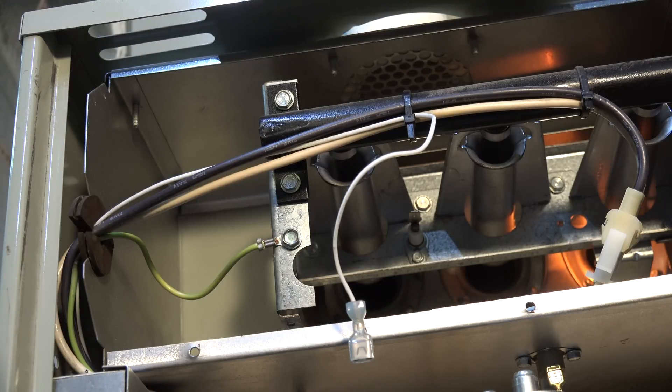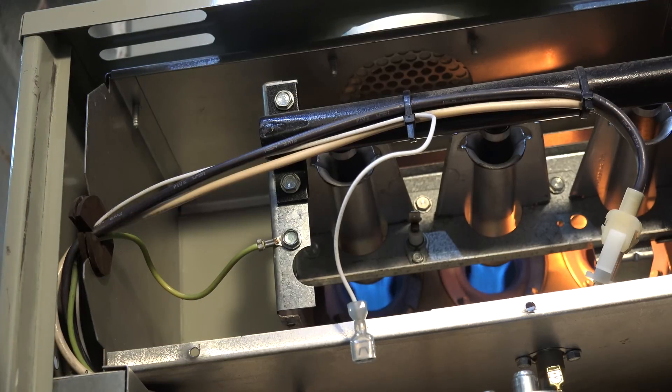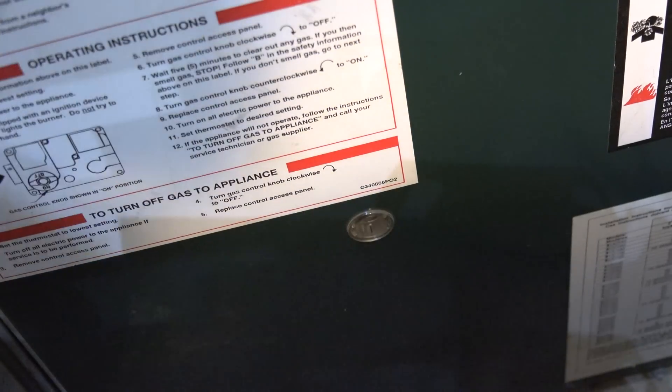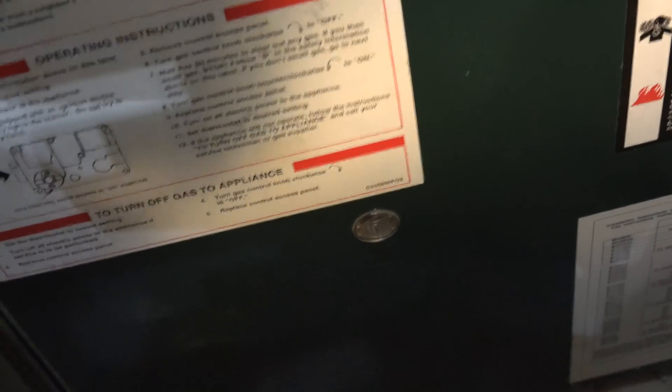You should always test this when you first fire up something after you've replaced a part. The hot surface igniter is coming on again and it's going to try to light again — it will do this three times. Because the flame rod wire is off, it's not going to light. Look in the little window at the bottom. After it tries three times and shuts down, it will start blinking a flame failure code. That means it's gone into hard lockout, which means it's working normally.